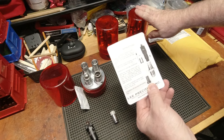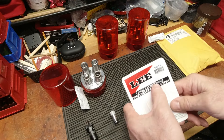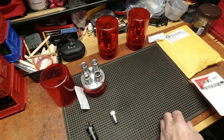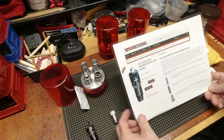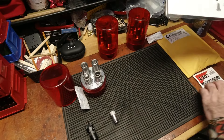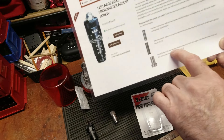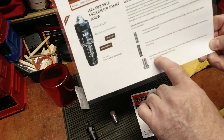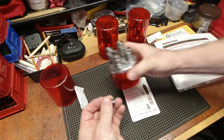I've been following this space for a while because I was only able to pick up the large rifle micrometer adjust screw. They make three versions: large rifle, rifle, and pistol — and I want all three. After doing a little more research, our friends at Titan Reloading bring clarity: this large caliber rifle micrometer adjust screw works with all straight-walled rifle cartridges that use this style of bullet seating plug.